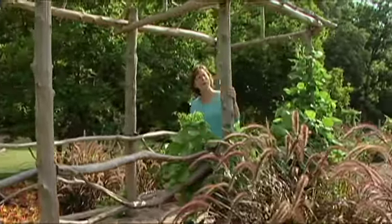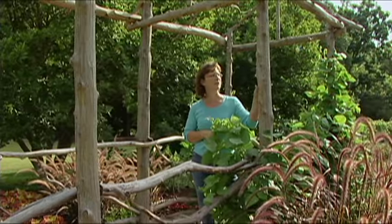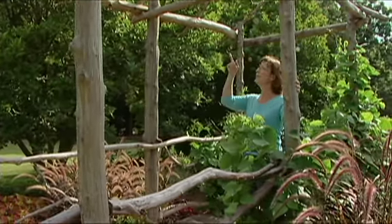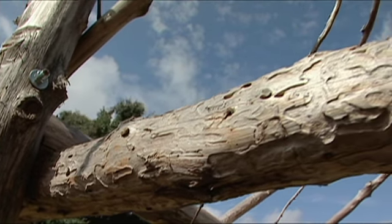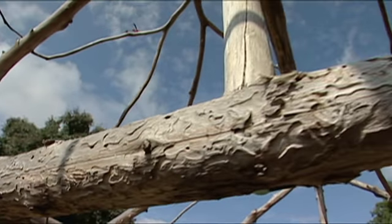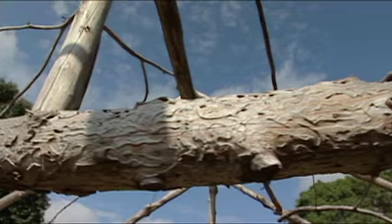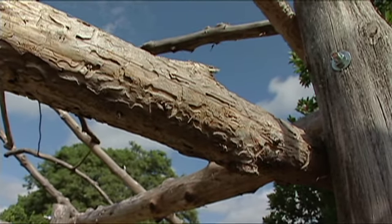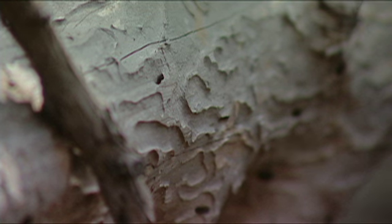We peeled the bark off of the trees here to help them weather better and survive longer. One of the reasons is because borers get under the bark of the cedar and sculpt around in there and really diminish the integrity of the wood. Some people really like the way that looks, but it's safer and stronger if you get the bark off before they sit around too long.